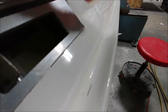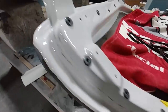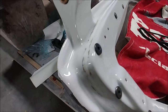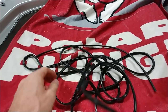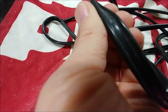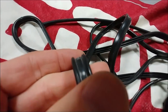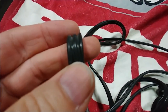Back on the doors: basically got most of that ProSeal cleaned off, then went around with a little bit of sandpaper and roughed up the paint where I'm going to be sticking the seal back on with the RTV — just black silicone sealant — and I've cleaned off the seal as well. One other thing we did: because the doors are fitting so tight, we cut the center section out of that profile on the lower half of the door because it was just fitting too snug. When the door was on the aircraft, you can see it looks more like a C-channel now.